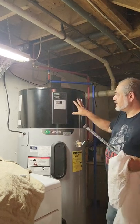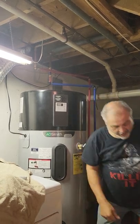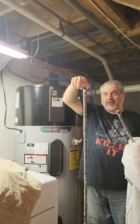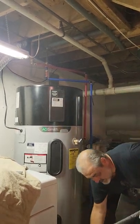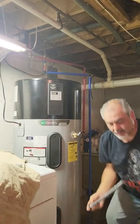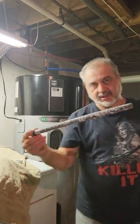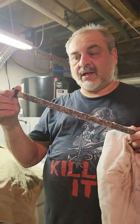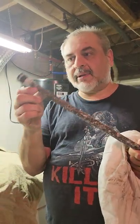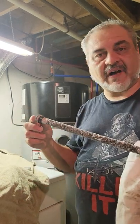What I found was, when I took this apart on the top, we have two anodes — not just one. Here's the original that I pulled out. That's the full-size anode. I assume because it's an 80-gallon, that's why there's an anode and a third. This already has quite a bit of corrosion on it, so it's been doing its job. The anode is there to rust before the inside of your tank does — it keeps your tank lasting longer. That's why I assumed they put two anodes in this one because of the large volume.